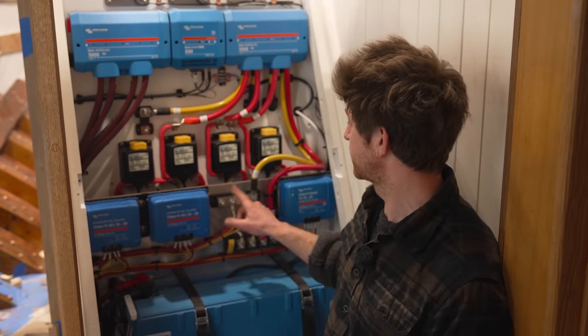Yeah. So as well as electrical work, there's also been a lot of plumbing work going on. And right now we're going to look at the black water system. That's the wastewater from the head. And one of the most important parts of that system is the holding tank, where that waste is stored until you can safely and legally pump it overboard when you're offshore or get it pumped out through a deck fitting at the dock. Now, holding tanks can be a bit difficult because they usually contain a lot of seawater, which is flushed through the head, as well as all the organic waste, and all that stuff can be very corrosive. So metal tanks often don't last that long.